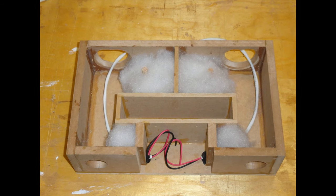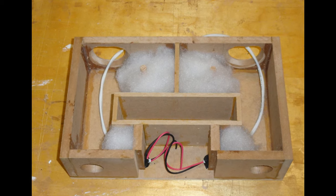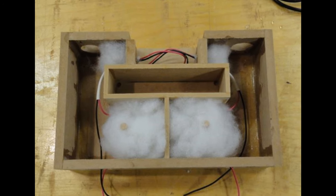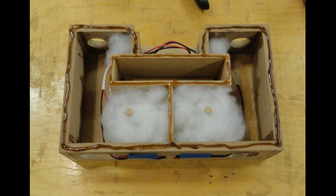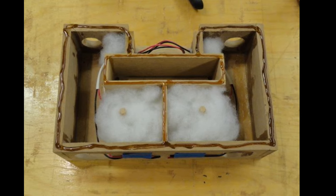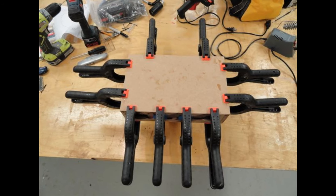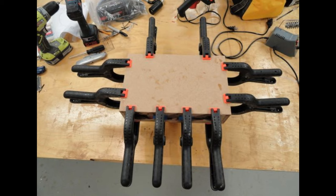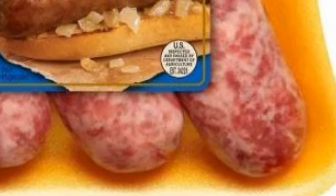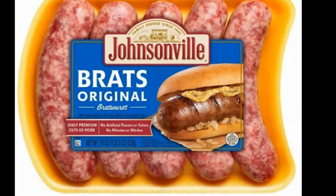I put a few wads of polyfill pillow stuffing in the areas where it would be difficult to get to with the top on. I tested the lines and made sure the filter was wired correctly before proceeding, as they won't be able to be removed after the next step. Next, I glued on the top with Gorilla Glue — the stuff that looks like honey. I used Titebond II wood glue for the rest of the cabinet, but just for the top I chose Gorilla Glue because it expands slightly and ensures a good airtight seal. Because there is no way my fat fingers are going to be able to caulk the inside of this cabinet.